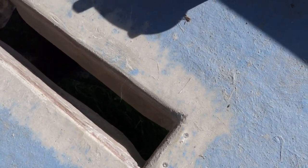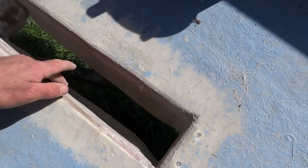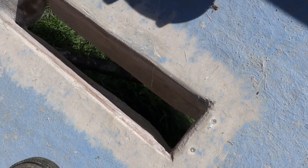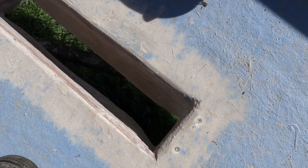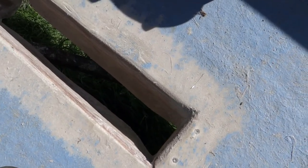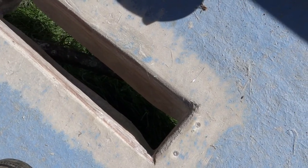Once the board's assembled I can put it in, finish cutting off this, sink it in and then probably seal the bottom again with that kind of microfibre putty. Get it fairly straight up and down. And then start going over glass layers from the inside of the box to the outside of the hole, and from the top of the deck to the outside of the box. I'll probably do a similar thing around the top of the box — get it in, sand it, make it curvy and nice, and then start layering it up.